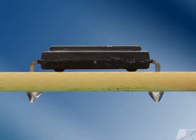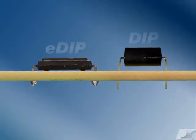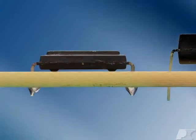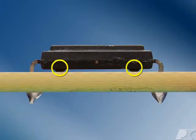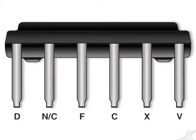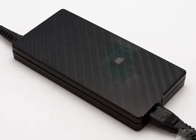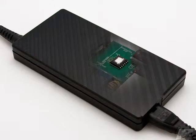Straight leads and reduced plastic thickness give EDIP a much lower profile over a standard PDIP package. At the same time, standoffs on the bottom of the package provide physical clearance from the board for flux removal and cleaning. The EDIP package provides 3mm of clearance between the drain pin and the nearest low voltage pin, and 1.8mm between the drain and any optional heat sink. This makes PCB layout easier. All these improvements make the EDIP an ideal package for low-profile designs like slim laptop adapters and LCD monitors.